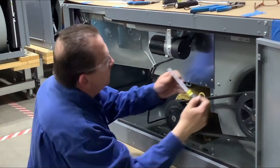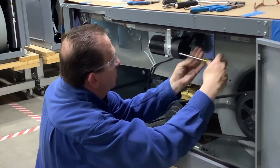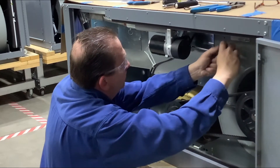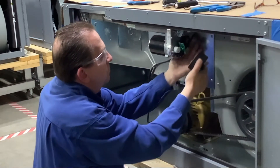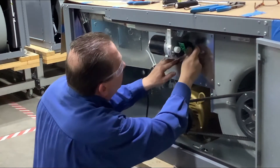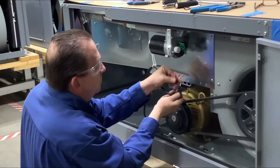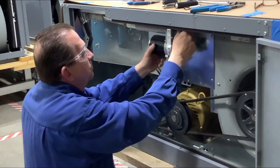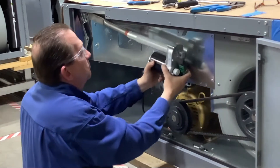Open the right cabinet door. There are spring clips inside the door at the top and bottom. Remove the large black cap from the back of the existing damper motor. It will be held on by two quarter-inch sheet metal screws or one T20 Torx screw, depending upon the age of the motor. Remove the four wires on the motor that come from the black SO cable — they are brown, black, white, and red — and set them to the side.